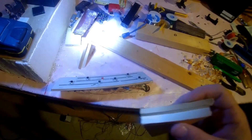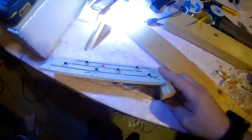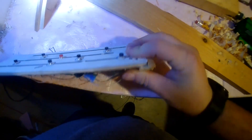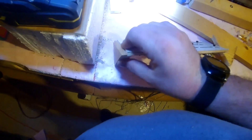I pulled out a new toy — I got some chisels a little while ago at a good price at Harbor Freight. So I just sat here and chiseled out a rabbet joint — I believe that's what it's called — and that gives me just enough room for this thing to sit on top of that rabbet. I'll glue that in place and then get my pin nailer and put a couple of pins in there to hold it up. I did the same thing on the other side — new tool, new technique. Never done that before, but chisels are cool to play with.